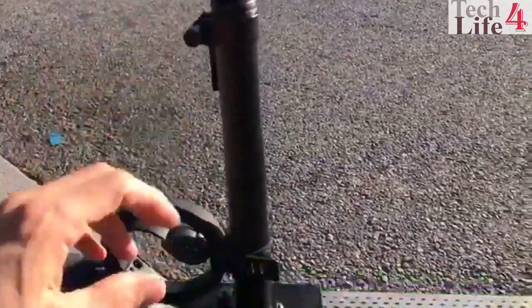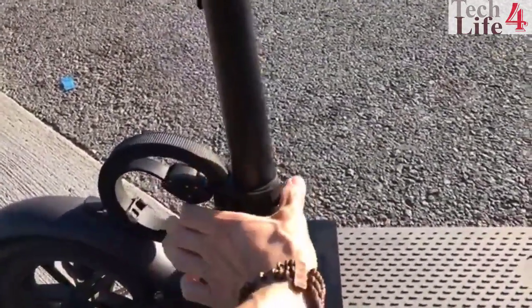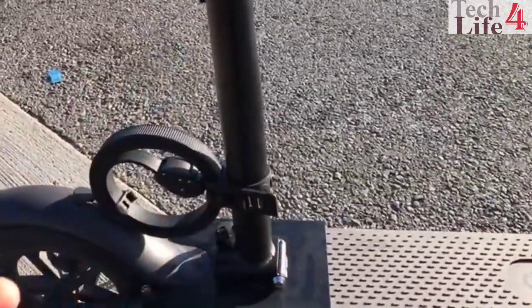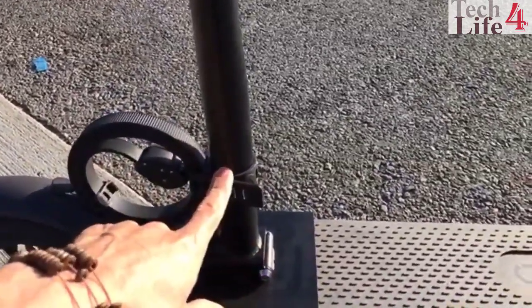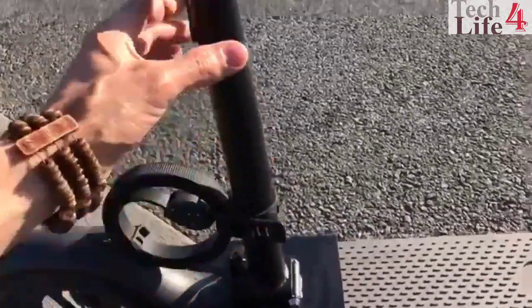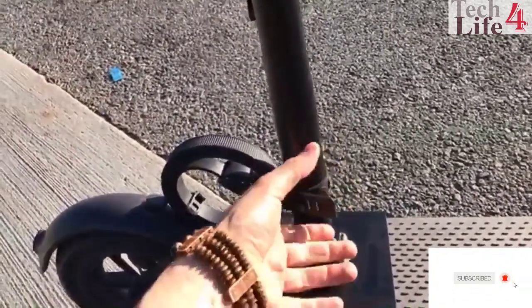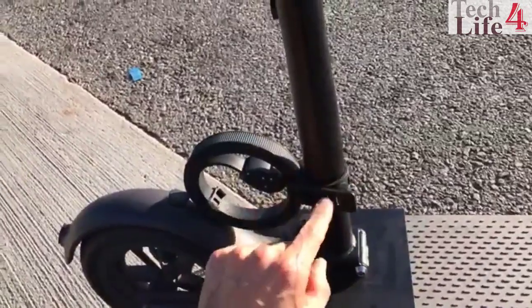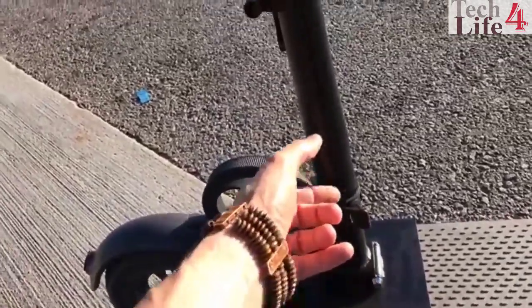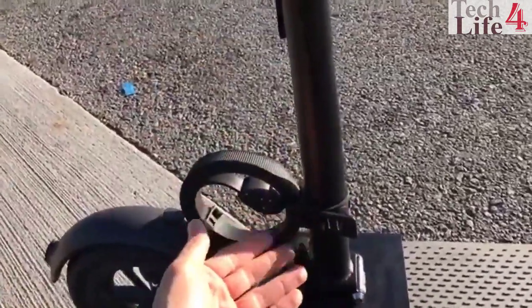It'll just be the pressure of the magnetic field, and then have a coil wrapped around the outside here, a thick coil of wire. And I might be able to just find a coil of wire without having to wind my own coil. I might be able to find one that has a center diameter of the winding, like when you buy a big coil of wire, and just slide it right over this, and then glue it or put a hose clamp on the bottom or the top so it just stays in that one spot, right where I have that magnetic field on the inside, where these two magnets are pushing away from each other, or throughout this whole area, have a big thick coil of wire. And then when I'm pushing down on this, see what kind of energy it produces, if any.